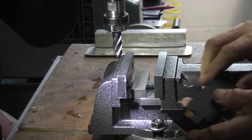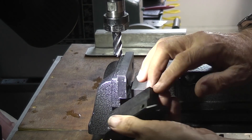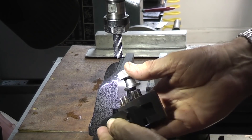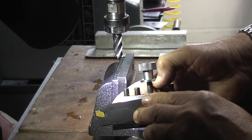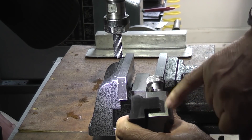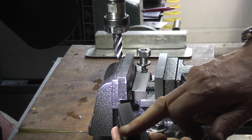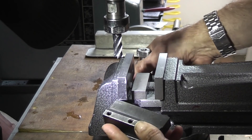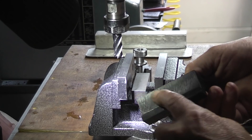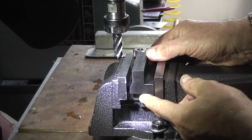I've moved over onto the mill. What I want to do — when I tried this out the other day — I found that the block width here, where the tool goes into the holder, is far too long and it needs some milling off the top. This was the tool holder, and you can see the parting off tool goes in there. There's a clamp on the top and you can see this holder sticks out too far from the tool holder. So I want to take five millimeters off this side so it goes further into the tool holder and reduces any leverage or vibration. The important thing is this is the tool face which is square, so I'm going to locate off this parallel strip into the vice.